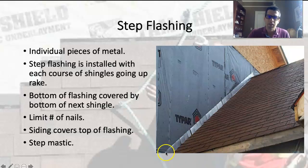This picture isn't the best — what should happen is this house wrap should overlap those step flashings. The way it's working now, if any liquid water gets behind the siding and hits this house wrap, it's going right behind the step flashings and not really accomplishing anything. A better installation would have been if the step flashings went on first, then the house wrap went over that, cut up from the roof a couple inches and taped onto those step flashings — a nice, tight installation.